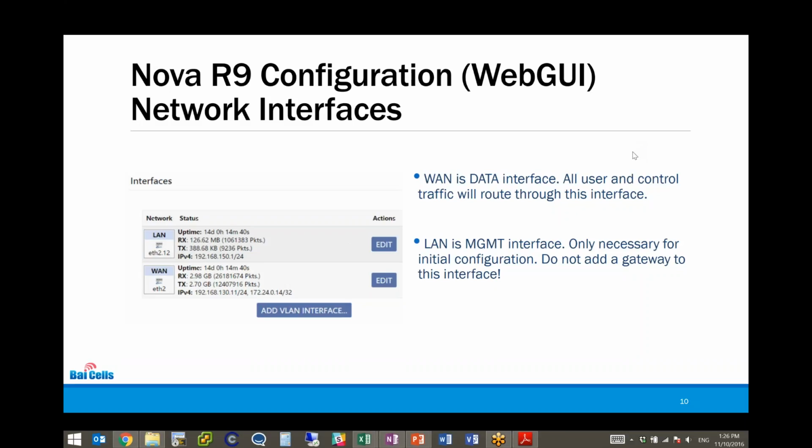What's the target signal strength for the eNodeB? I like to say negative 94. Yeah, I think anything around negative 100 is usually the target. Our hardware team is telling me that it should be negative 105 or greater, but I haven't noticed a huge drop-off between negative 105 and negative 110. But anyways, if that gives you an idea,